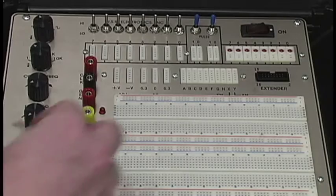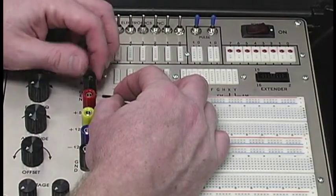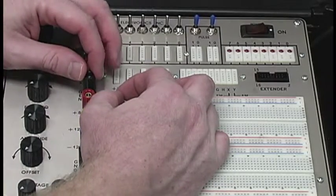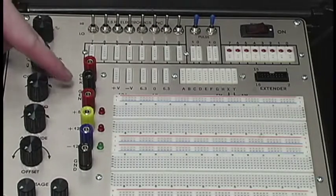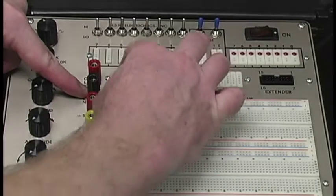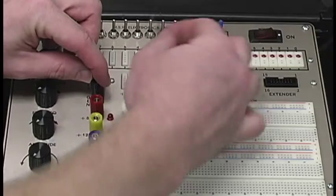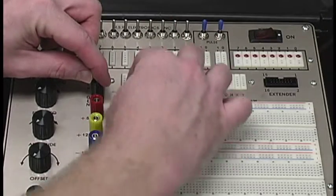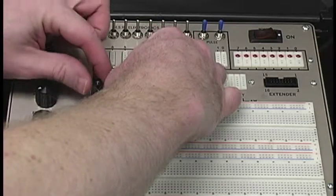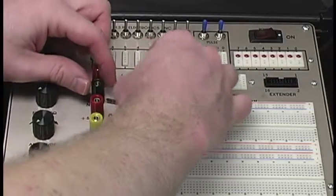And again, if you remember everything we said in the safety video, we're going to build this thing without any power to it. When you raise these things up, there is a small hole inside of the screw shaft. What you do right there is you take the little tip of your wiring, you put it inside that preformed hole, and then you go ahead and you tighten it down.